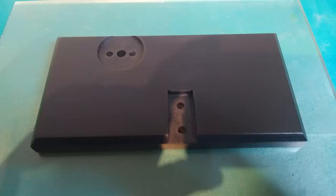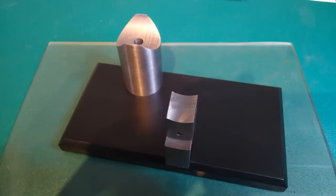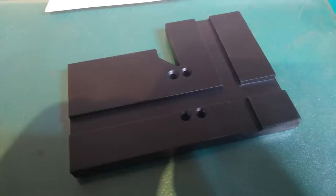I made the base plate off camera from a piece of 15mm thick Celeron, a modern type of phenolic. The material is strong, wear resistant and dimensionally very stable. The column for the grinder and the grinding table are recessed into the base plate and secured with two flat head bolts. The grinding table with the cross guides is also made off camera from Celeron, and will be provided with a steel top layer after mounting the tilting column.